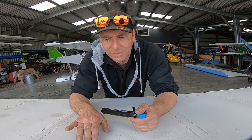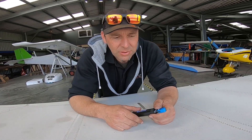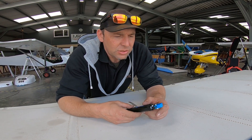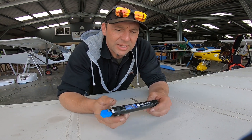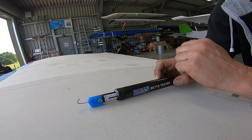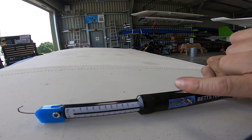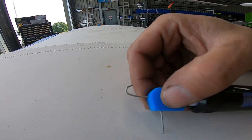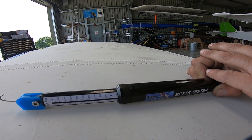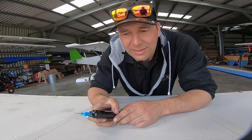But certainly as we're getting hands on these skins more and more, you can feel they're on the way out. I can understand why these guys want to change and go to the X-Lam. I thought it'd be interesting to have a look at what tension these skins break at. It should normally be a thousand grams on Dacron. So this is our break tester — I'm just going to pop that in there. That doesn't feel too bad going in. I'm going to pull this on. That's where it should be — it's already gone. You can see you've got a small rip. Let's try that now to epic fail. On to a thousand — a thousand one hundred. What about twelve hundred, twelve fifty? Yeah — changing these skins: very good idea.